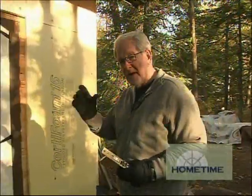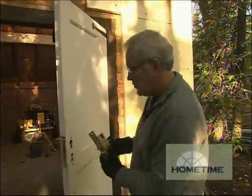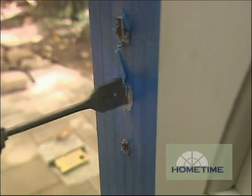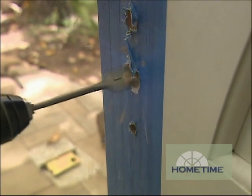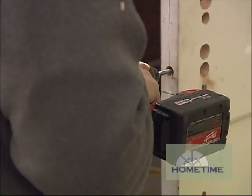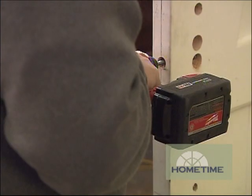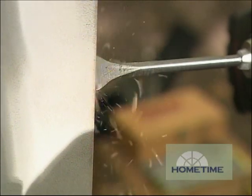The tricky thing is you have to cut out the area of the door to slide this whole thing in — that does get a little tricky. You have to be careful, measure carefully, and I like to drill my holes through first to line up the mortise. The big thing is it's a four-inch deep hole by seven inches in an inch-and-a-quarter door, so you have to be accurate when you plunge cut.